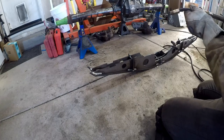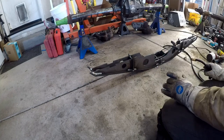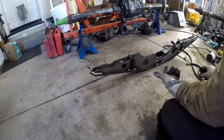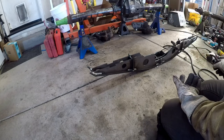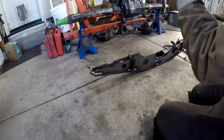Just stacking up perfect bead after perfect bead — this is a glorious day. This might be my very best day of welding period of all time. Now it's time to do these same corners but on the opposite side. If you're going to do these little tacks to tie in those beads, it's best to do it while they're hot, because then it'll sink into the middle better and won't stay high and raised up. It's been really nice to just lay down good welds. I mean, I haven't come from this — this is something I've had to learn. So to get to the point where I can show these welds off is great. I took a picture earlier and put it on Instagram, and Ballistic Fabrication reposted it pretty much right away. Thanks Ballistic for reposting.